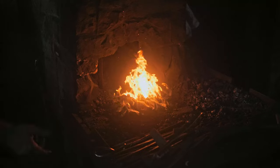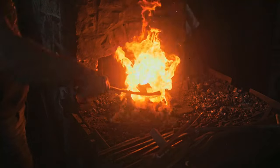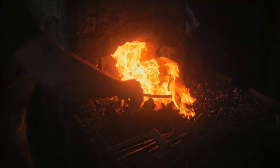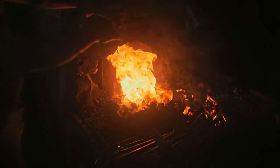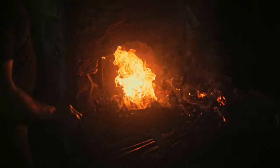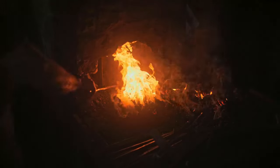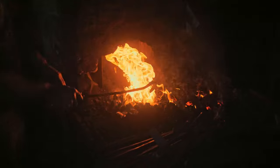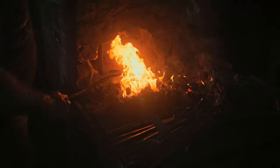About five minutes have elapsed now and I've let this stuff coke up. As we pull it aside here, you can see that it has turned into nice little chunks that hold together. So basically, when you put it on wet, you kind of cement your own little fire, and then as it cokes up it becomes larger chunks anyway. You can see the dust around the perimeter here — I can just move that in and it doesn't seem to be a problem. You still have large chunks of coke that you can move around and adjust your piece. It works just fine.